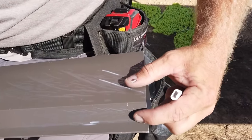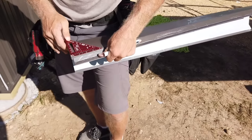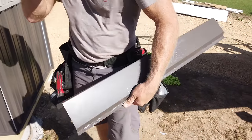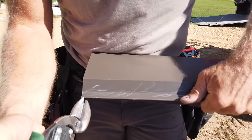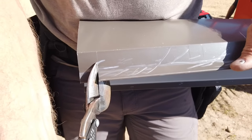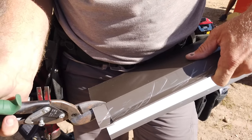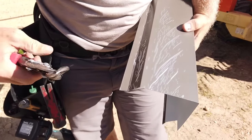So I'm basically marking one inch up on this leg here and I'm going to cut this out. I've got to do it on both sides. Now you'll notice I'm going to use my green snips on this side so that it doesn't stress the leg of trim that I'm keeping. You see how it stresses this side but it's not doing anything to this one. And then when I get over to this side I'll go ahead and use my reds.